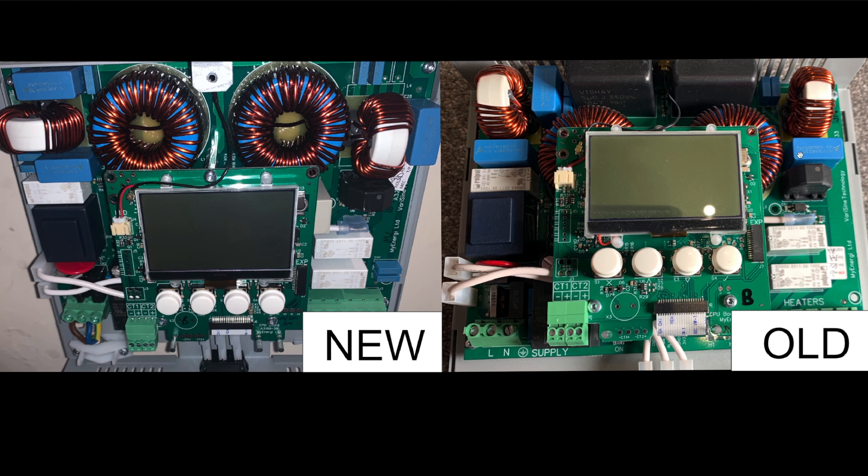These two big inductors sitting below are probably doing some big power smoothing of the 240 volts. I'm sure people in the comments will correct me if I'm wrong. You can see that, on the face of it, although there are similar components in different places, there are a few extra capacitors here compared to over there, and the two relays are in the same place. As far as the circuit board on top goes — the one which has got the smart electronics — it's got 'CPU board' written on it, so it gives the game away really. That board is the thing that runs the unit; everything else is really the business end, giving the power to the immersion heater.